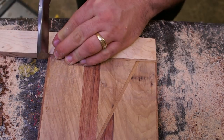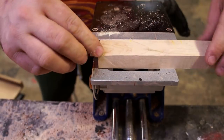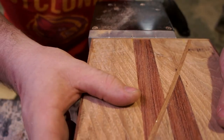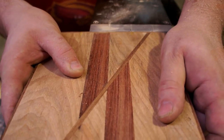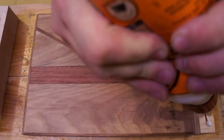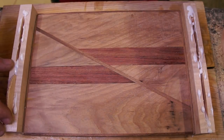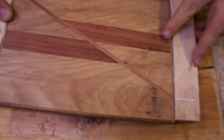I came back and trimmed everything off, made sure all those corners were at 90 degrees, and made sure there were no overhangs that would create gaps. I used that chisel to make really exact marks on where I needed the table saw to cut. Throughout this project I don't think I used a tape measure once — I was doing all the measurements relative to and off of the pieces I was working with. I find that a lot of times when I do that it's a lot easier not to make errors, because there's one less step in between.